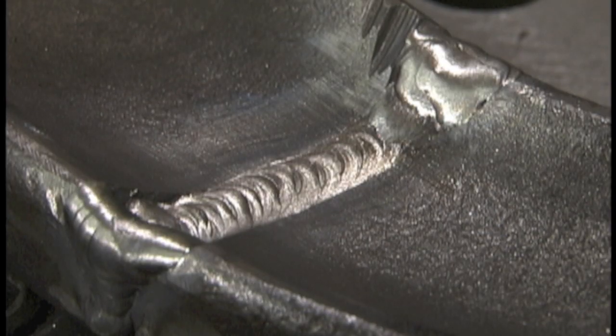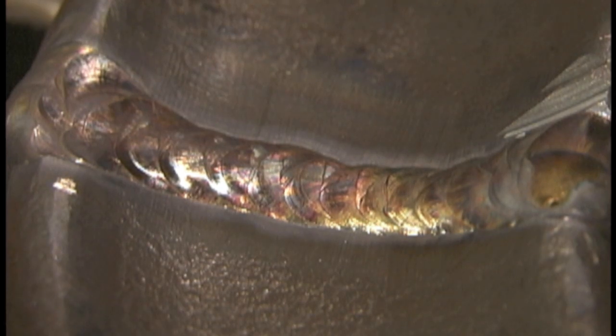I'm using a stubby gas lens kit on a 17 air-cooled torch. It makes the torch smaller and gives nice shielding gas coverage — helpful on ends like that. Now I've got it contoured with those ridges, so I'm doing one final pass to try to make it look decent, pushing a little extra metal in where it's a little low. You'll notice sometimes I'm leaving the rod in the puddle, sometimes I'm not — just showing you both ways. Both are acceptable depending on the material and application. Dipping in and out lets you watch the front edge of the puddle and ensures fusion. Taper off nice and slow again so you don't leave a crater crack — and there you go, that's done.